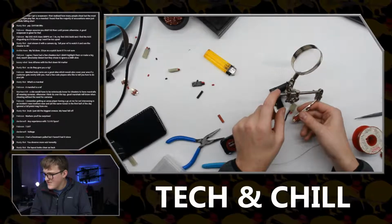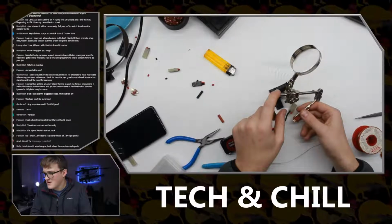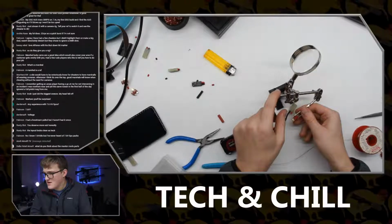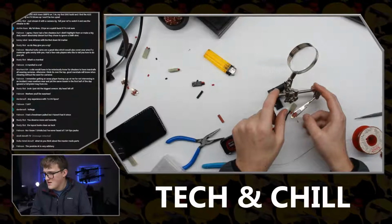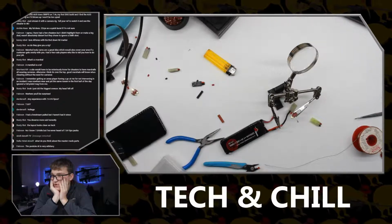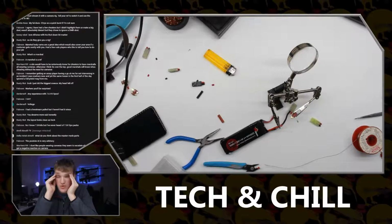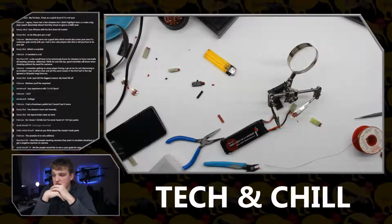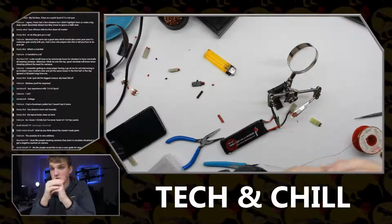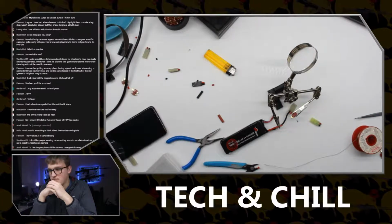7.6 HV lipos. What? I don't know. Sorry, I'm getting crossed over here. A 7.6 voltage battery, I've not heard of. Lipo cells will give off a certain voltage when they're charged, which is 3.7 volt nominal per cell. So when you have 2 cells, you get a 7.4 battery, and 3 cells 11.1, and so on. Sorry, I'm just doing maths in my head.